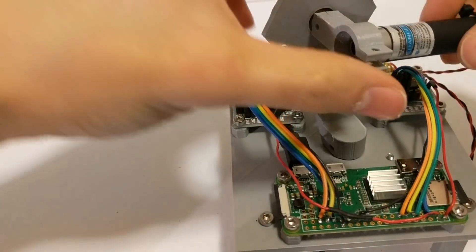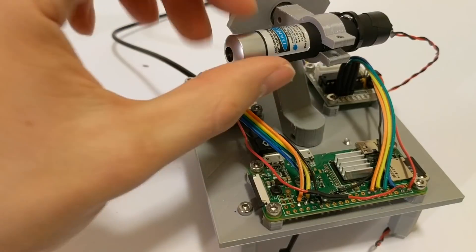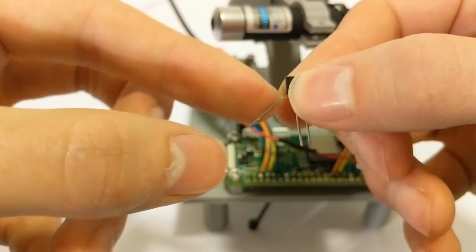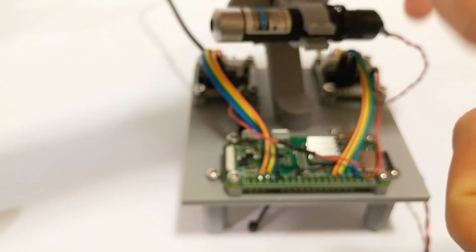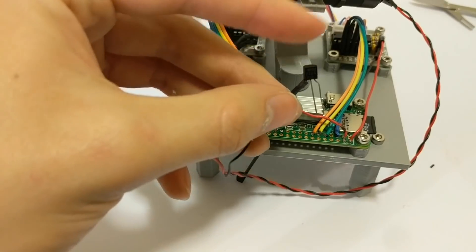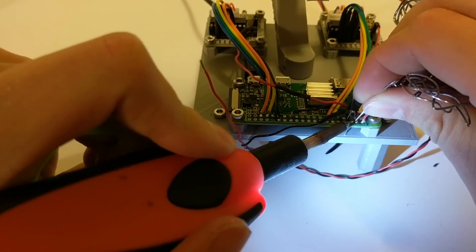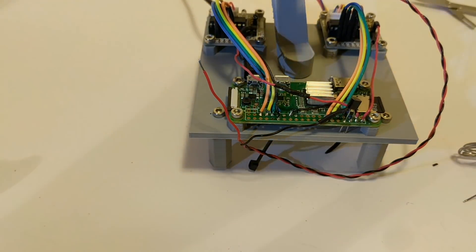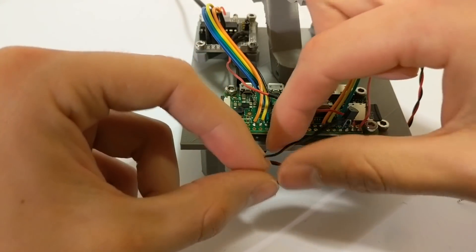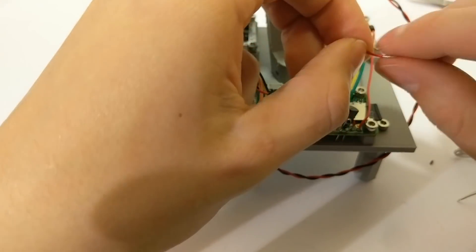Slide it on in. With the flat side facing you, take the left arm to the ground of your laser, twist it around and solder it on. With the front face out again, put it in these two holes right behind those two red ones. The last thing we have to do is put the positive lead of the laser into the 3.3V GPIO, and then we're good.